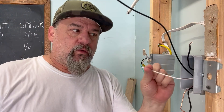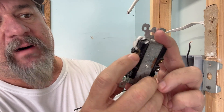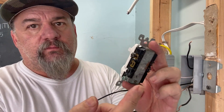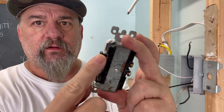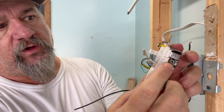That's what I mean by pigtailing down — stick that in the box, fold it up nice, push it back. Now for the hot wires: notice these have a little bond between them. You could separate the hots and put one on each side, but there's no need — just pigtail down your hots and put them on one side. That's the switch side, and that's your hot side, opposite the silver terminal.